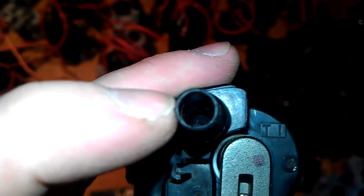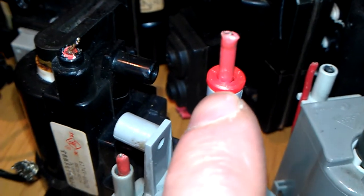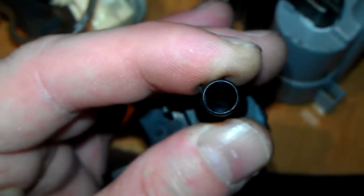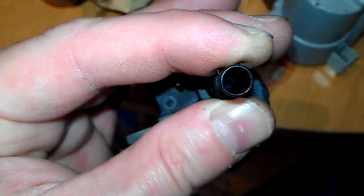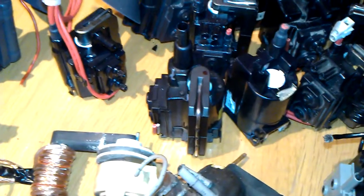Good tip. So if you find one that's got a hole in it like so, and there's no catch on it — you see, like this one here, this one's got a catch, which has a piece like that to push in to hold the wire. You push the wire in once you've taken the insulation off the end and it locks it in. Same with that one, just needs a plastic cap. This one is basically the wire was pushed in without the cap and it just holds inside the contact. It's like a piece of rubber which is full of carbon — carbonised rubber. Good thank you to my friend, High Voltage Projects.